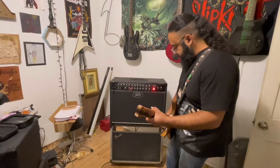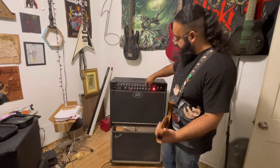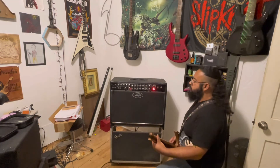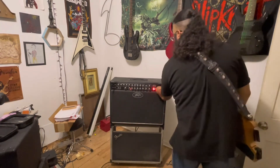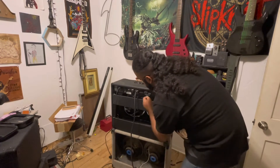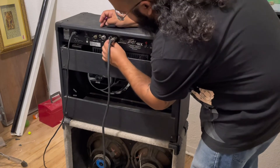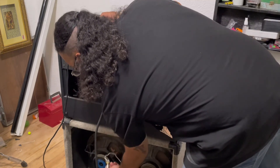Let's see how this sounds now. Hmm — palm here against the top. I was afraid of that. So now we're going to do something different: throw the amp on standby, turn the whole thing off, wait about 30 seconds, flip this back over to 16 ohms, pull out the actual speakers from the top and leave the speakers in the bottom — make sure that everything is correct right there.